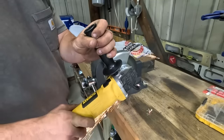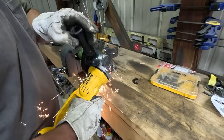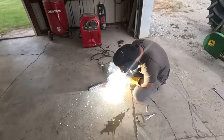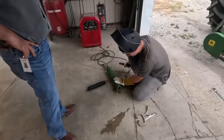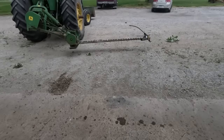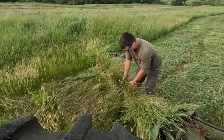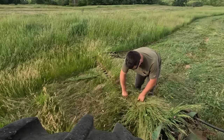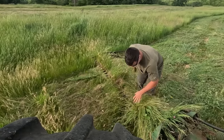And prior to me figuring out that I didn't have this hitch pin properly installed, I tried to fix the spring. So I bought a cheap one, and the spring's hook part was broken. So I cut it off a spring I bought and tried to weld it on, but that broke in a couple minutes. So that didn't work. Coupled with the bar always tripping, the sickle sections themselves weren't too sharp and the whole thing was quite dull, so it didn't cut very good.